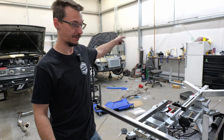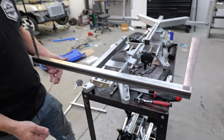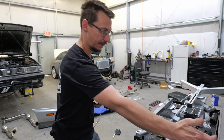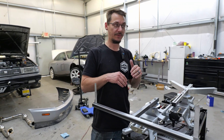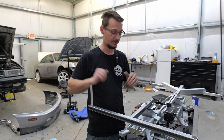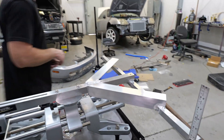I set this on the table — we've already straight-edged the table and confirmed it's perfectly flat. The gap from the base to the table was seven and seven thirty-seconds on either end, which tells me it is perfectly straight, meaning when we put it on the car there should be nothing that makes it a wonky alignment. The old aluminum ones have that issue — they're a little off — I'm going to go grab the straight edge to show you what I'm talking about.